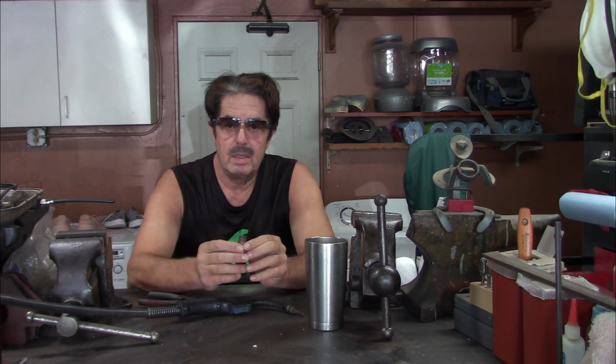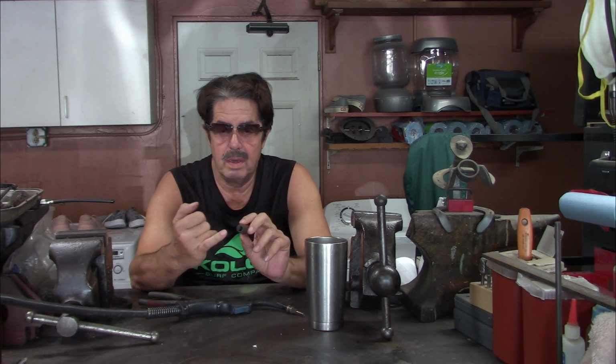After you have it cleaned off in here, you can get some of that nozzle dip or that anti-splatter spray, and I left you the links down below. Let's say you don't have that around. When I'm out at the club, we were sitting around talking, and the guys came up with a couple of other clever suggestions. One, you could put a little Vaseline in here, and rub it around. That would do the trick. You could put grease in here. That would do the trick, and then wait until you have a chance to buy one of the others. Like I said, there are many uses for the anti-splatter spray. That's in a previous video.